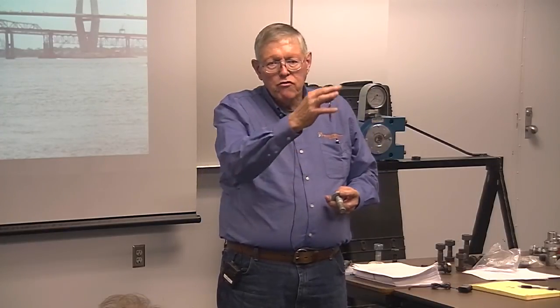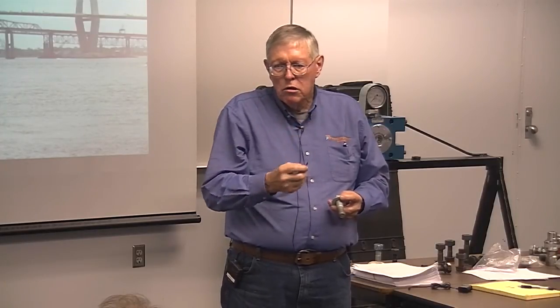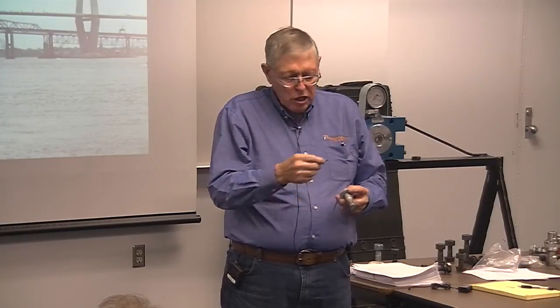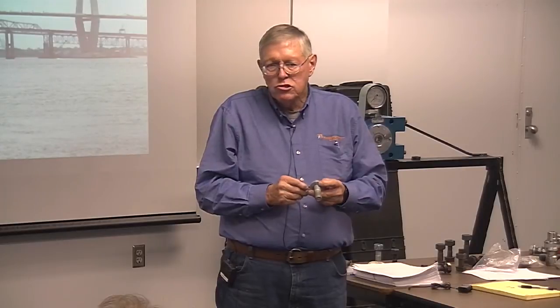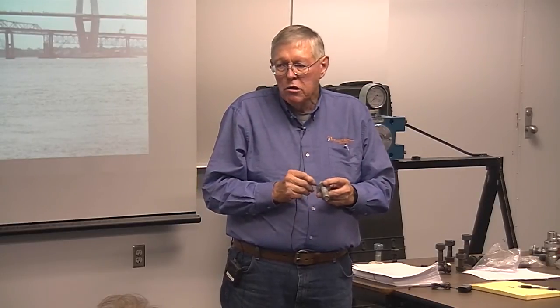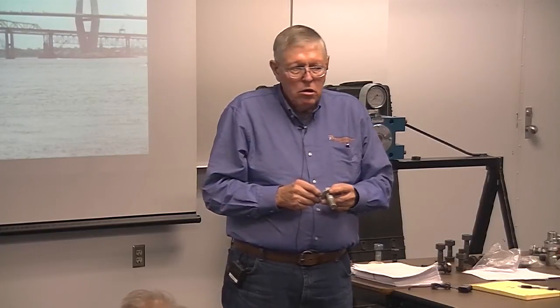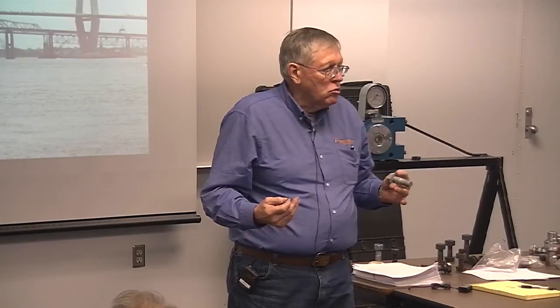That iron worker on the front gets accustomed to it, and it sounds right. Then he checks with the iron worker on the back, who taps the steel or something. The guy checks the last 3 or 4 bolts. Are they all good? If I got 2 refusals or 3, if I got 3 openings, I got too many. I got to hit them a little harder. But basically, they're tensioning bolts by sound and feel of the wrench.